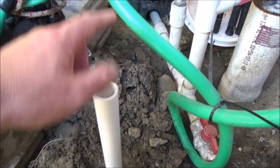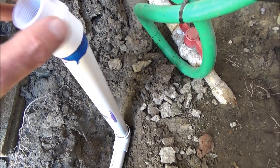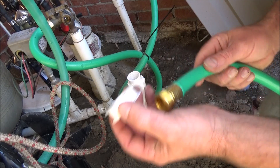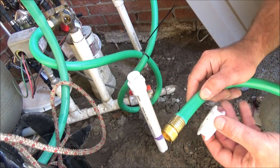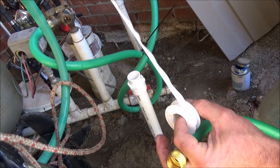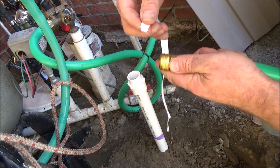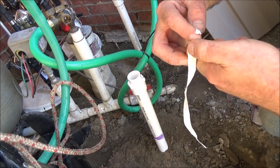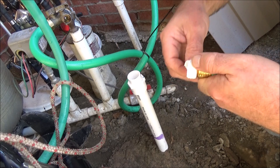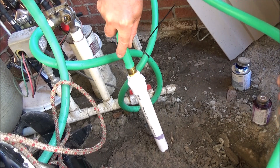I need to put a fitting here for the hose bib to connect to. I've got this fitting that a garden hose will screw into, and it fits over the one inch pipe. You see it's threaded inside? That's where the male end of the garden hose fitting goes. You could just thread this in, and if there's a little bit of leakage it's not a huge problem, but I'm going to use some of this Teflon thread tape. You peel some off, make sure it doesn't stick to itself — it's not sticky but it'll cling. Then you want to go with the direction of the threads, make it nice and tight. This is going to fill in all the little tiny gaps in the threads.